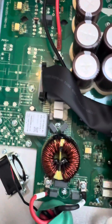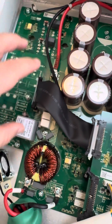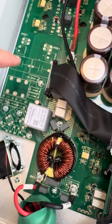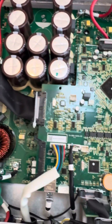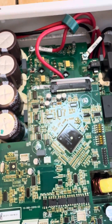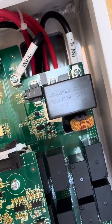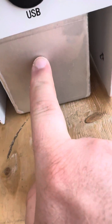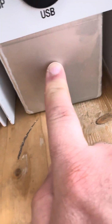It's missing all of the solar gubbins. So I'd expect to see on this side the solar connections, the MPPT trackers — all of that looks like it solders onto these connections here, so this area would be populated if this was a H1. Everything is really well connected. On this side you've got the DC to AC conversion going on behind the back — all these large thick cables go into this sort of secondary piece, and this module here appears to be where the DC to AC conversion is happening.